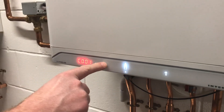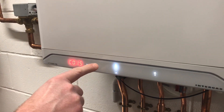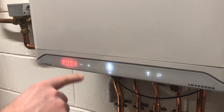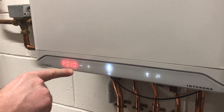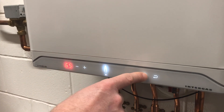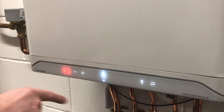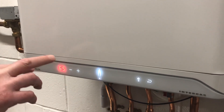Come over here, select parameter 15 and the spanner. Then parameter 10 is your central heating output. What you do is go to parameter 10 and press the spanner to adjust it. This value is in percentage — in the installation guide the percentage is translated into kilowatt output.